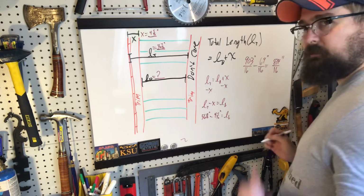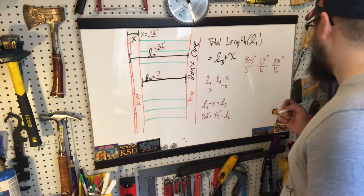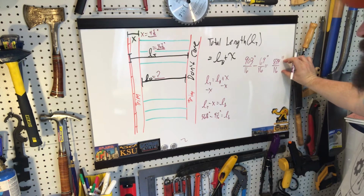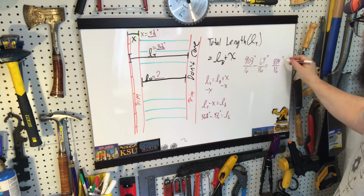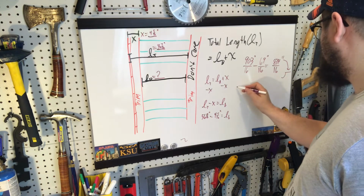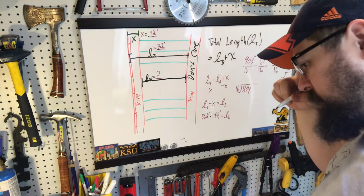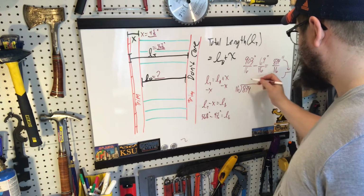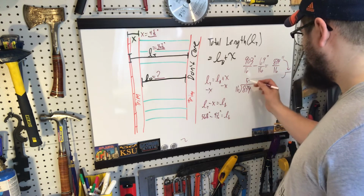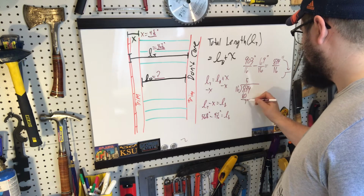Remember, this is all in inches. I use inches because you need more precision than if I use feet. There's just more conversion, so I just use inches on the tape measure, and that's why they use them. All right, so of course, if you remember which way to divide, you rotate this down into this position. So you have 16 goes into 834. Again, because I already did the math, 16 goes into 83 5 times. 5 times 16 is 80. Let's bring down the 4.